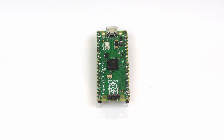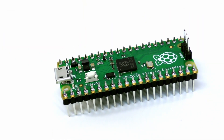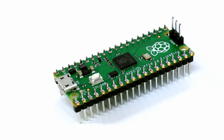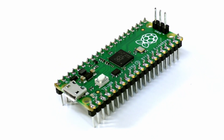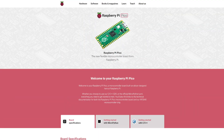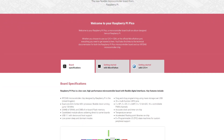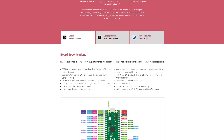DMA is also integrated very tightly into this, where you can take data coming in from a sensor — let's say over SPI — and then use that with the programmable I/O state machines to fill up a buffer and send that to a different peripheral device. To learn more about the Raspberry Pi Pico, such as pinouts, datasheets, and the SDKs, you can visit pico.raspberrypi.org.